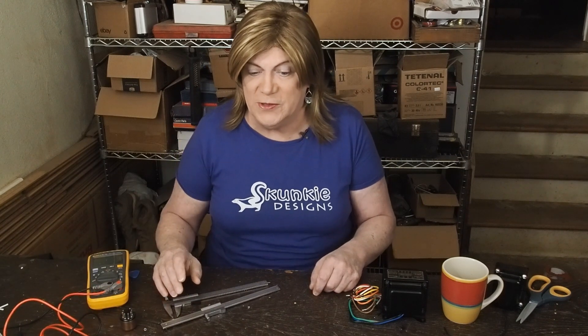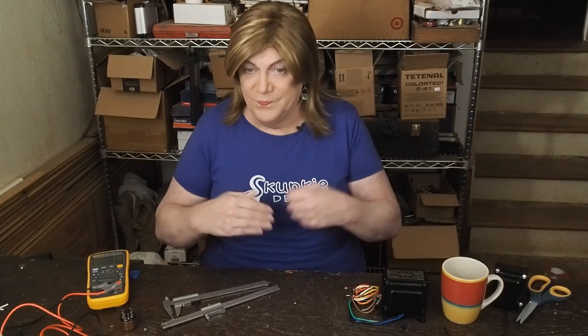Be careful, guys. You need to check this stuff before making these mods. You can't just take these parts and drop them in without checking things before and after — that's what makes these mods complicated for a lot of people. And honestly, it's dangerous. If you don't know what you're doing, there are hundreds of volts inside those things. If you probe the wrong place or your finger touches something it shouldn't while you're holding on, it can literally make your heart stop and kill you. Think about your skill level, do some reading and research, and watch videos about tube amp safety before you ever go inside one of these. I can't stress that strongly enough — this is not something to mess around with.